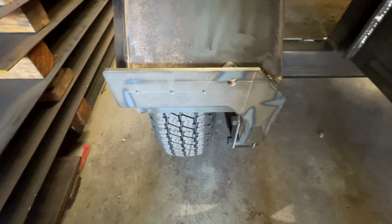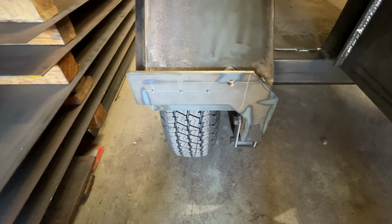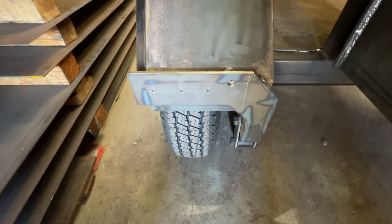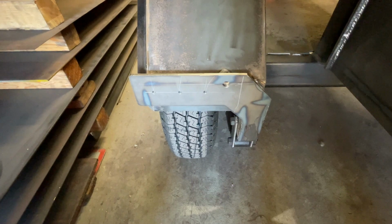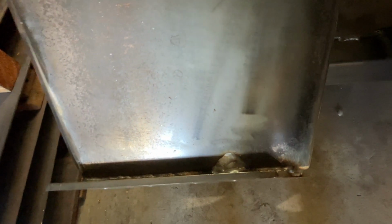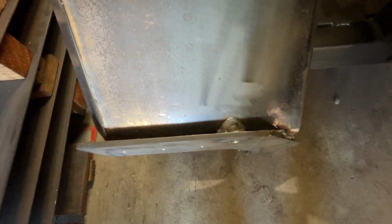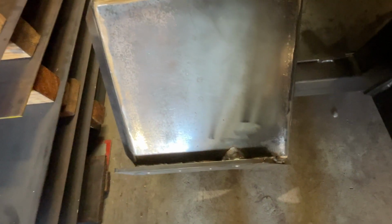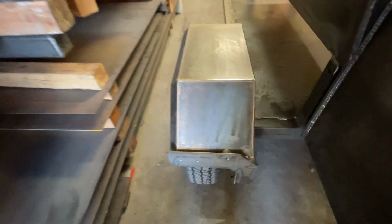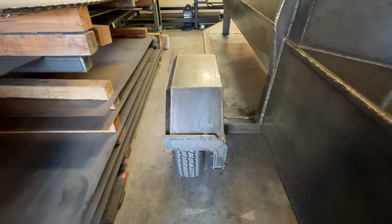One issue that I had is the lights are fabricated from the same mold. So the spot for the lights is not mirrored, it's the same. So when you switch it to the other side, it ends up being on the top. Well, my fender didn't quite work. So I notched a piece of that 1/2 inch conduit, cut it on the same angle as the fender, and welded it in there. It's not the most beautiful thing, but it works. It'll keep the water out, and that's the important thing. And when it's painted, you're never even going to notice. I'll notice, but no one else will.